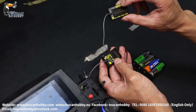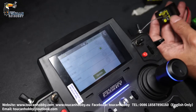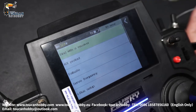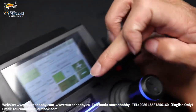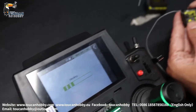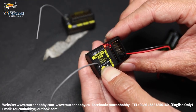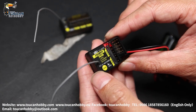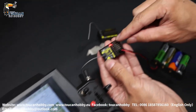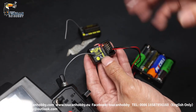So the same process applies for the FGR-12B — choose FGR-12B to update here. Let's go out and try binding it. RX setup, binding with receiver, routine, number one, binding, start — press and power it on, three seconds. Bind successful! So now it is already binding. You see it stopped flashing — it's already connected to the receiver with the radio, so now you can operate with your models.